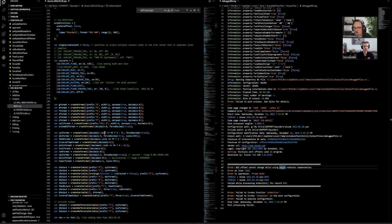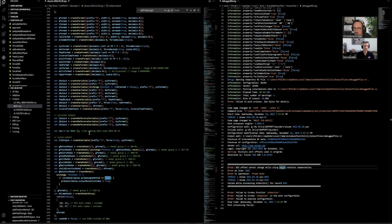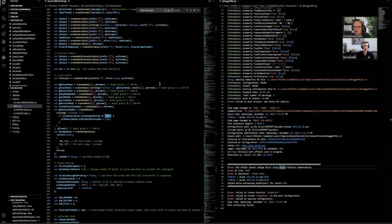And in these variables, a lot of other functions are turned on and off. They're just not user editable from Fusion. They're just built into the post. The post properties are the things that you actually see when you click post in Fusion, and it gives you the choice of turning them on and off with radio buttons or checkboxes. Yeah, exactly. So everything you see in the NC program on the right-hand side, that's where you can control post variables and outputs straight from within Fusion. But some of these variables are built into the post, and they're meant for nerds like me to go in and change things.